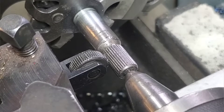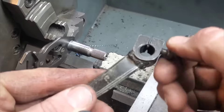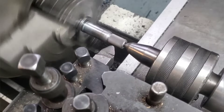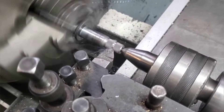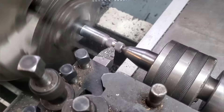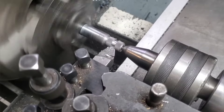Speaking of work of art, it's looking damn good. There's only one thing left to do — cut that half-round in the center where the bolt's going to go through to tighten up that spline that goes over top of it. I'm lining this up in the center, but the tool bit has quite a bit of rake on it from a different job, so only half the tool is sitting on or below center and the other part's above it — it's only cutting on the left-hand side, which is a problem. Let's back this out and get the height set up correctly.